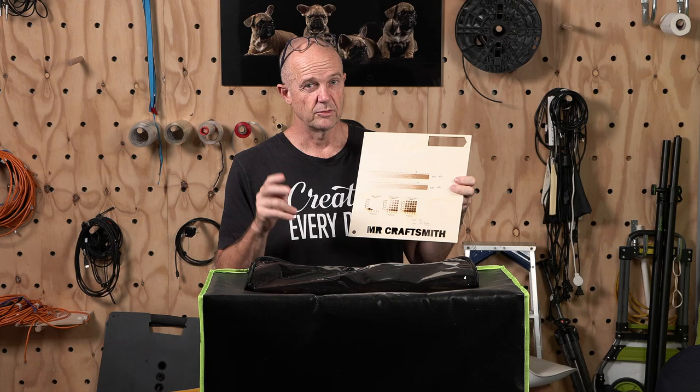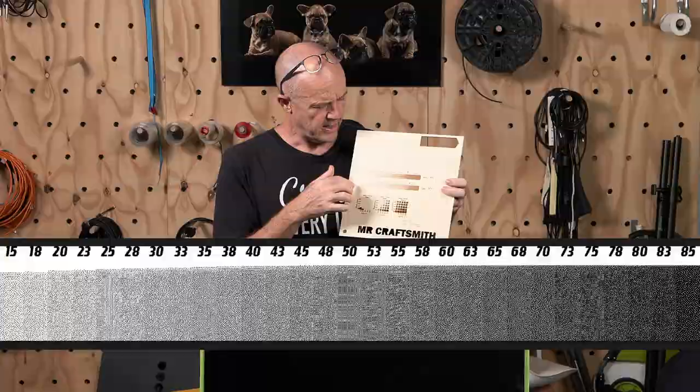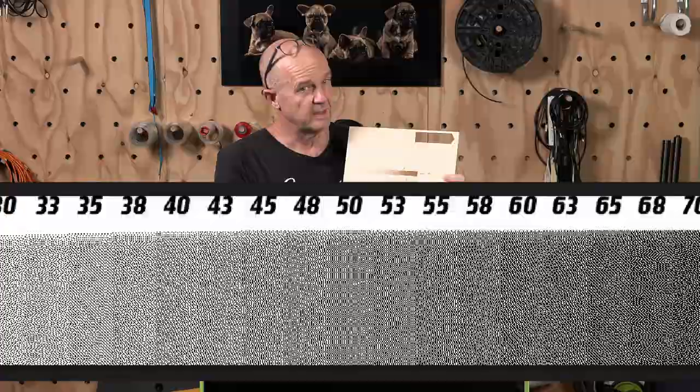The second test is what I call the grayscale test. With diode lasers, we don't really have the ability to do grayscale per se, but what we do have the ability to do is test a dither pattern. A dither pattern is just a series of dots, and it's the density of those dots that will actually simulate the grayscale. I've processed this in ImageR — I have the offline version — to prepare the file ready, as I've done in the past with the slate and ceramic tile tests.